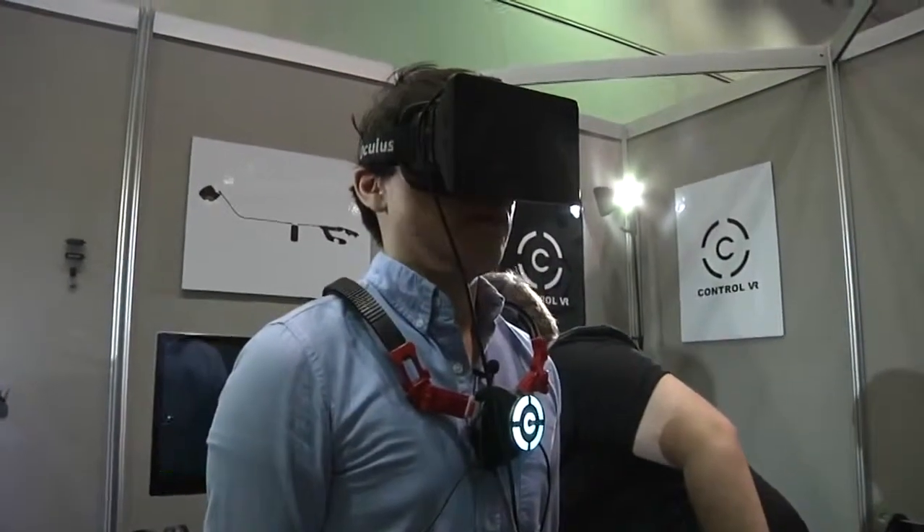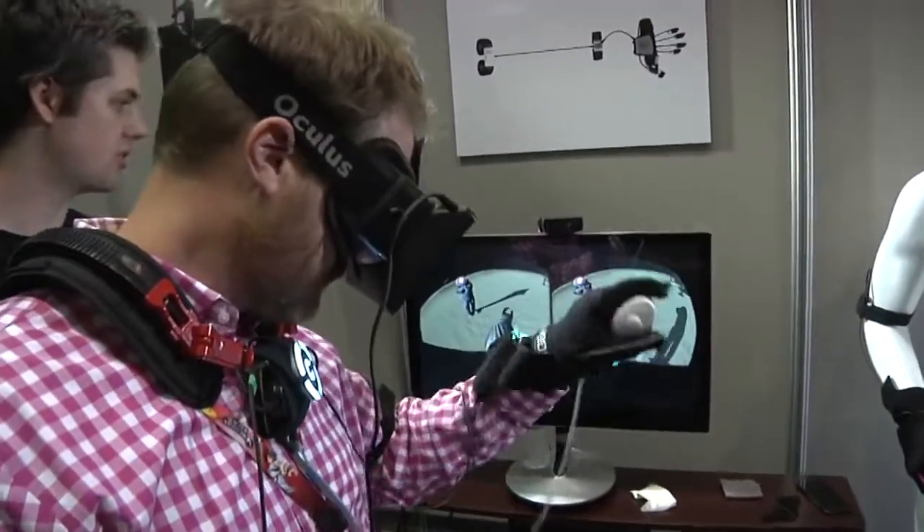The relative movement of the system is 100% precise, but it's limited. You calibrate — stand with your hands at your side — and it maps you to a skeleton. The accuracy is only as good as how accurately you align to that skeleton, so you might be 95% of the way there. When you bring your hands up in real space they might be slightly off in the game. To correct this, we're working on an optical verification system using a depth camera as a second stage of initialization — looking at the location of your hands, adjusting your shoulder rotation, and scaling your skeleton to fit your personal skeletal scale. That's something like the Leap Motion, or an inexpensive webcam. We don't have to wait for Leap Motion to get more range since we can bring it up close, get a good track, scale your skeleton, and lock in.